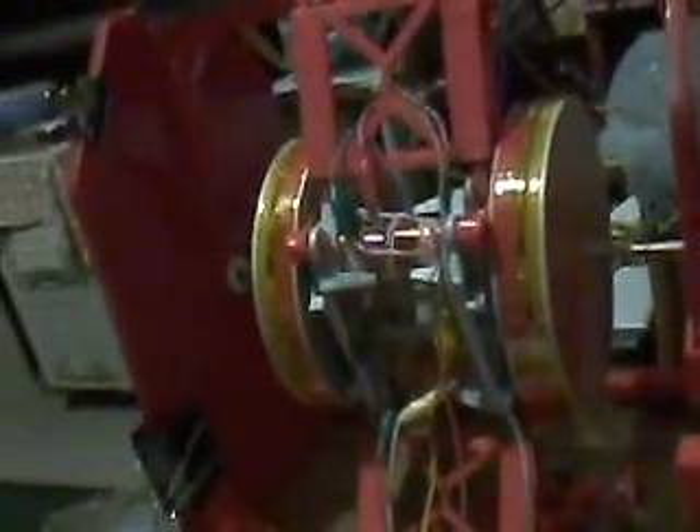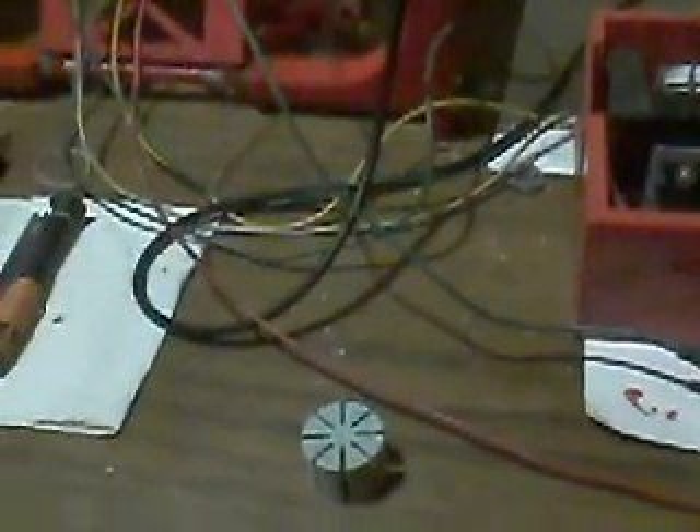It's giving very good isolation, which is what I'm interested in. But it's a shame I'm not getting a good power factor conversion. I think the reason is that the power required to operate these flux trap switches is quite high — I've got two coils, one on each end, and each coil is using about 100 milliamps at this resonant frequency. You can pretty much hear the frequency anyway.